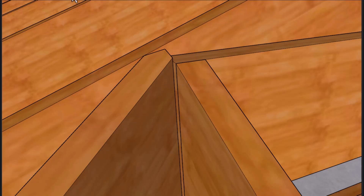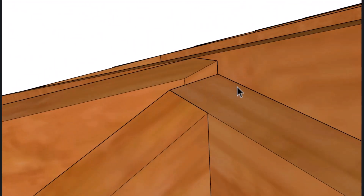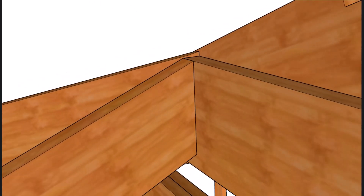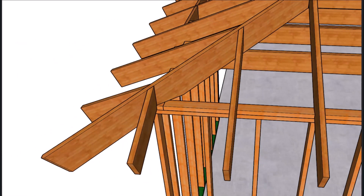This is probably going to be the key spot for you to focus on — you can see here where this is a little higher or lower. I know a lot of people get confused when installing a hip at the top and bottom and making everything blend in. I also want to point out that the bottom part of the hip rafter uses a 2x10 for the hip and 2x8 for the rafters, and it won't always be full bearing — but most building engineers accept this as a common construction method.